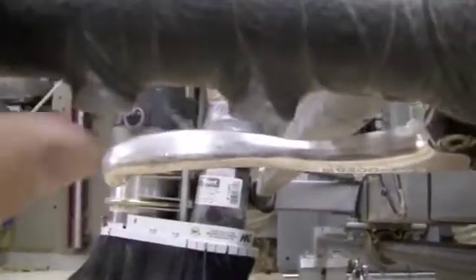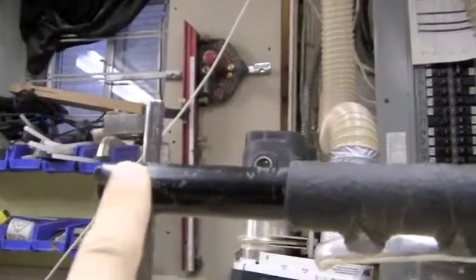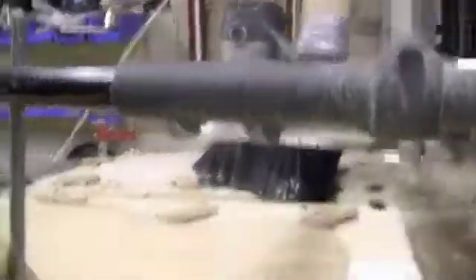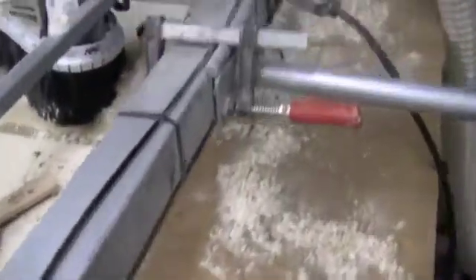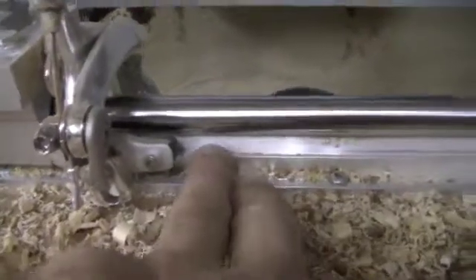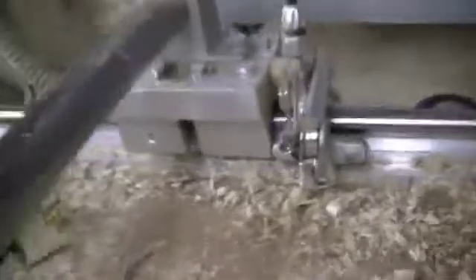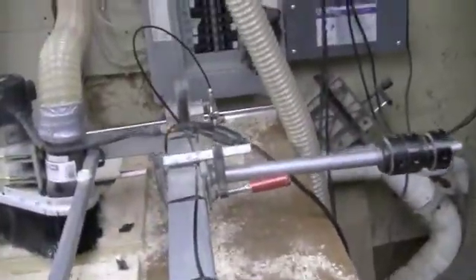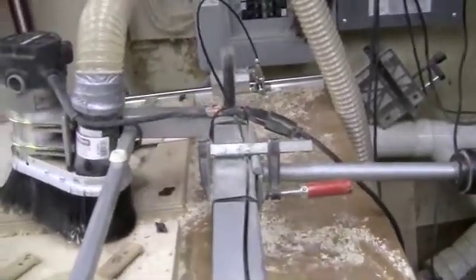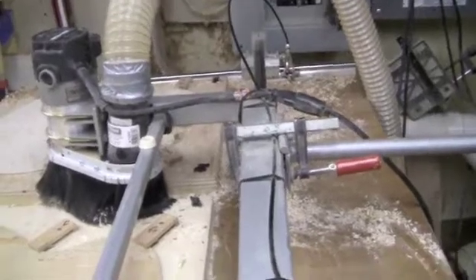Underneath here I welded on a couple of bolts and inside those are some grub screws, and this allows me to move this in and out. I haven't moved it since I set it, but it allowed me to make the accurate adjustment when I first set up the unit and that's held very solid. In addition, on this part I've mounted a bicycle brake device and the brake cable comes all the way through to this side here, and it engages the holding device for the shaft. So when I slide this carriage back and forth I can pull the brake handle — it locks on that side and allows this to move straight back and forth without wandering, allowing me to make nice straight lines as I go across.